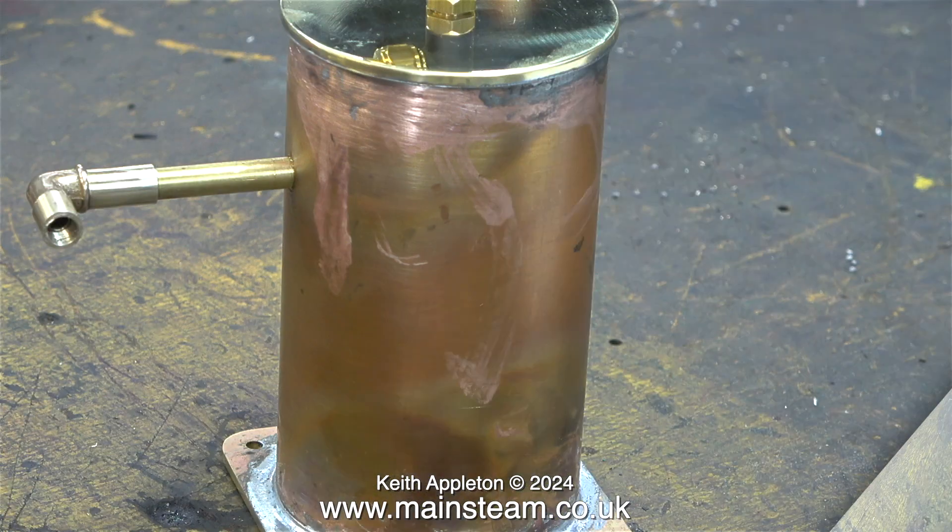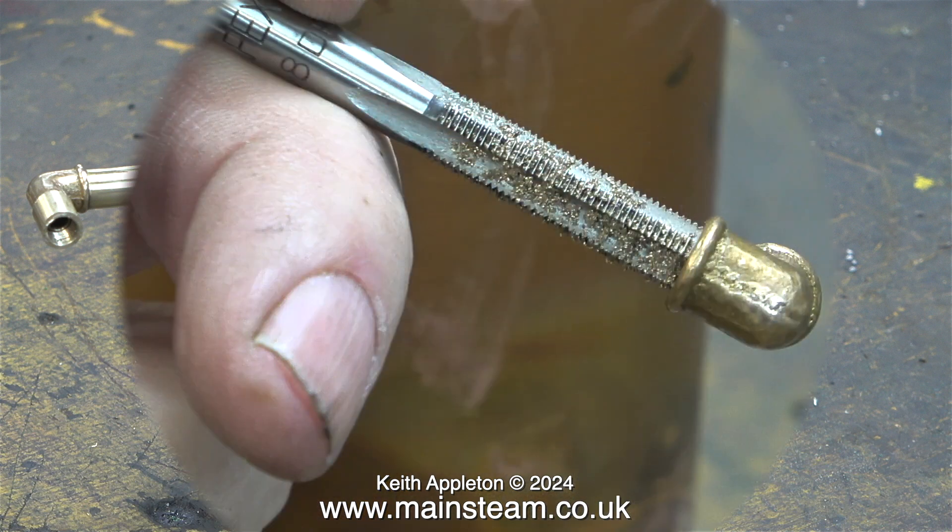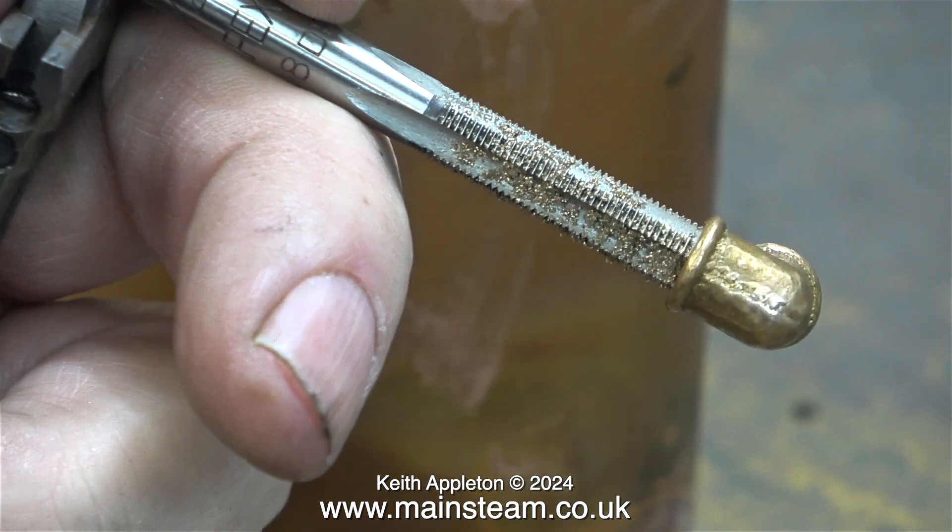I made a couple of female adapters, one longer than the other, and here you can see them screwed in position. I'm going to come clean — the reason for having to do this was I cut the pipe the wrong length before I soldered it into the condenser. I'm making up the pipe run to the chimney, and to do this I need to change the thread form of yet another PM Research ¼ by 40 threads per inch elbow.